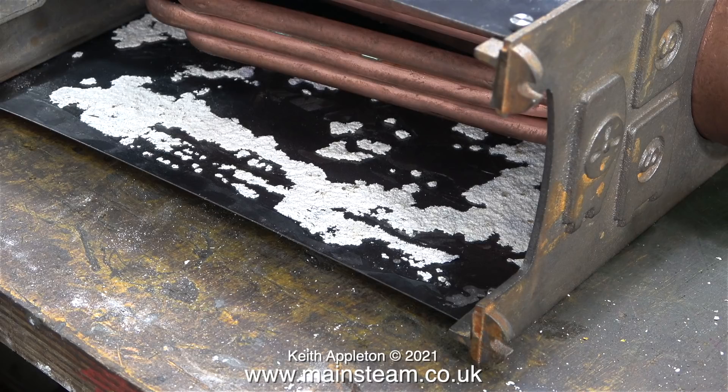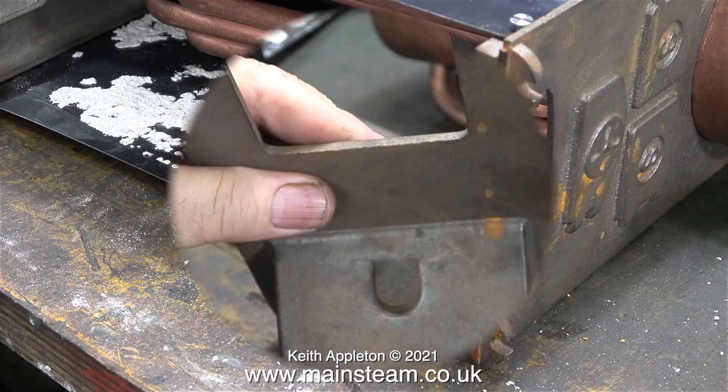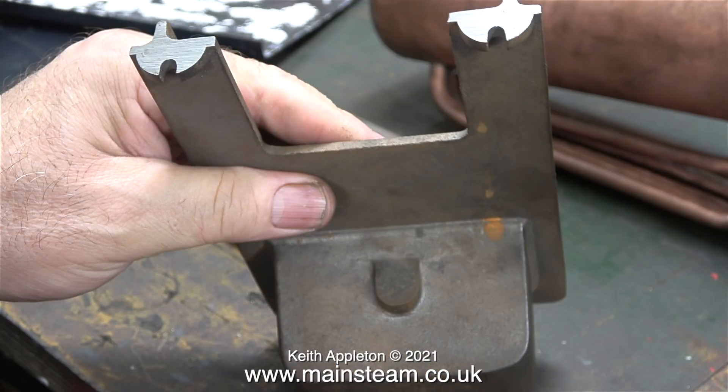In this clip you can see a really bad problem with the feet of the cast iron boiler plates. I haven't cleaned this one up and it's very different to the other one. With the feet left in this condition the mounting lugs could easily crack when you bolt the boiler in place onto the baseboard. The feet need to look like this — perfectly flat — then there's no chance of fracturing the mounting lugs.